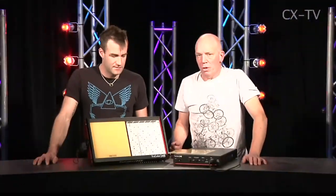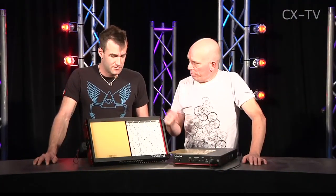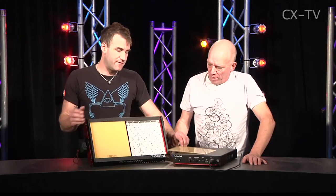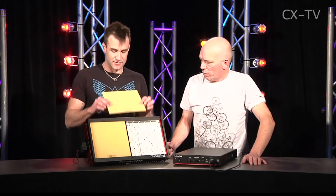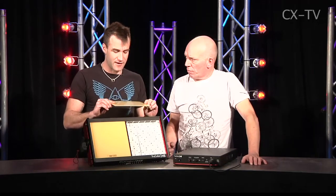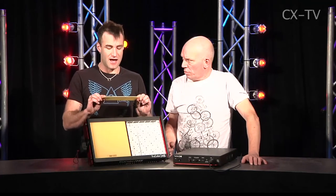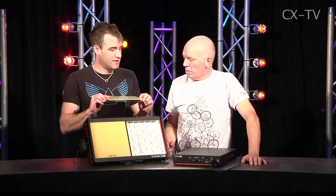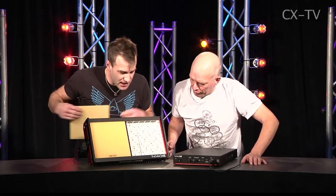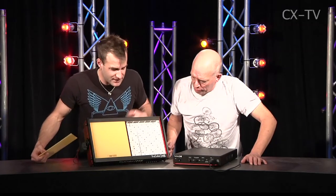Let's have a look inside. So, why? The whole idea of this is that we get a very predictable color temperature light source. This is actually what's making the light — it's a phosphor-coated panel. If you think of this as an unwrapped fluorescent tube, that's what this is. And it sits in front of these panels in here, which have lots and lots of little blue LEDs.